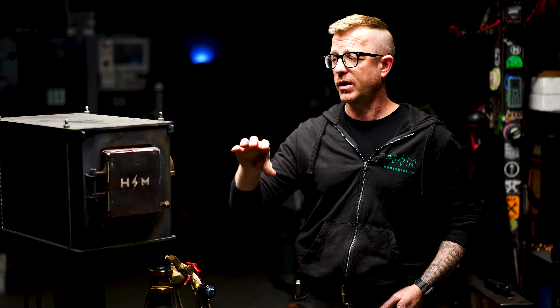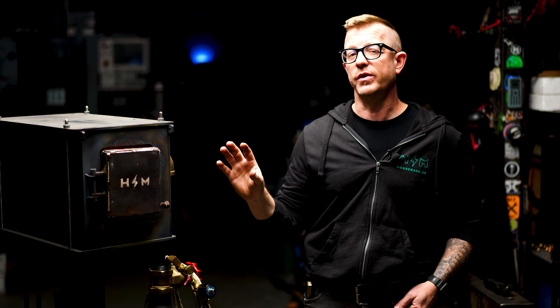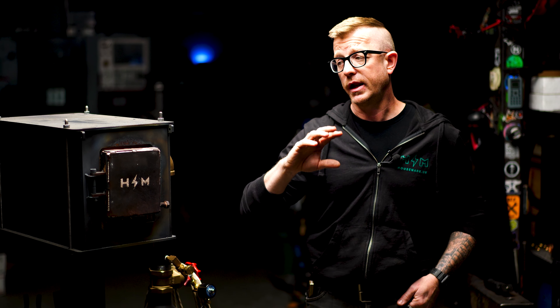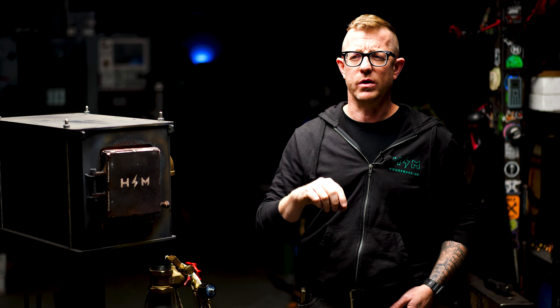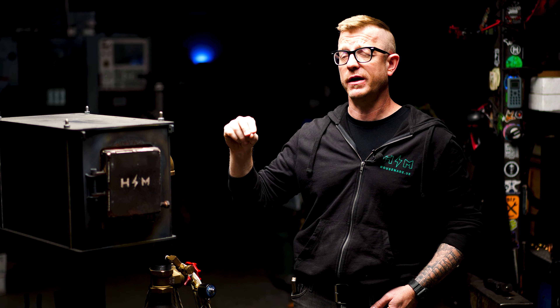I feel very strongly about the Apollo being a safe forge — that's why it's built with quarter-inch steel plate. When I see other forges blowing fire out two feet, I feel concerned. Even so, when I'm done in the evening and the forge is still hot, I roll it to the middle of the room, leave the doors open, and let a fan blow out the heat down to sub-1000°F. Some of the most experienced blacksmiths have lost entire workshops due to carelessness, so keep that in mind.